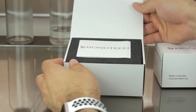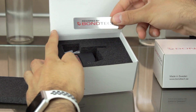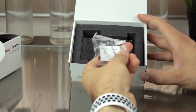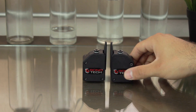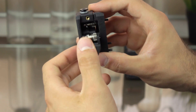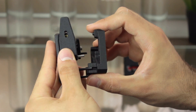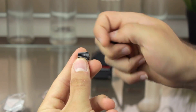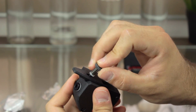The unboxing experience is very exclusive and well-packed. The first thing we find is a sticker that I'm going to put on the Mega, and we get it on both the standard and mirrored versions. Then we find a bag with accessories to check out later, and finally the extruder itself, almost fully assembled and ready to mount. We will mount them mirrored. Looking closer at the extruder, here we can see the dual-drive gears for that perfect grip Bondtech is known for, and the 3-to-1 gear ratio gear that pops out. In the plastic bag, we find the gear that will attach to the NEMA 17 stepper motor, and the thumb screw for the filament idler, which I'm going to install in place.